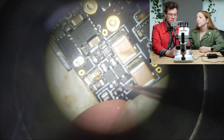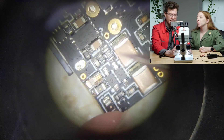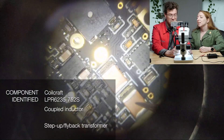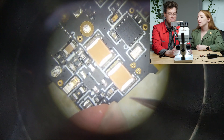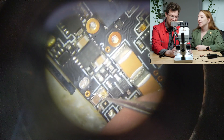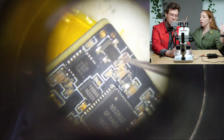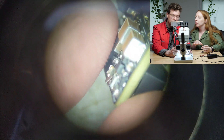This part right here is also interesting — this is what generates the high voltage. You can see the components on this part are much, much larger than the rest of the board. Those are capacitors, but they're like the biggest surface mount capacitors I've ever seen. And there's a nice big Coil Craft inductor on the back side — Coil Craft is a company that makes really good inductors. I'm guessing that it's some kind of LC resonator, which will ring up between this inductor and these capacitors to generate the high voltage — adjustably. And then these over here — this is what actually couples into the enclosure that you wear around your wrist. It presses outwards against the metal, and it's kind of springy a little bit. It's not glued to the enclosure — it just presses on, which makes sense since it has to be conductive.